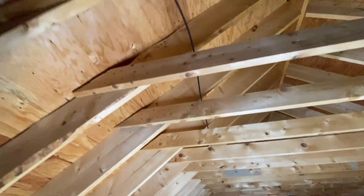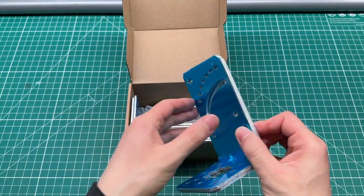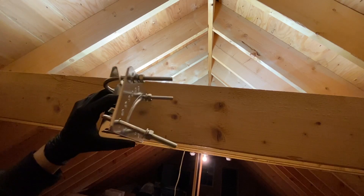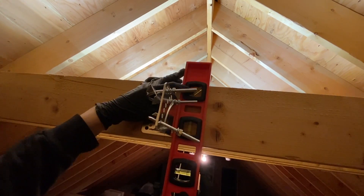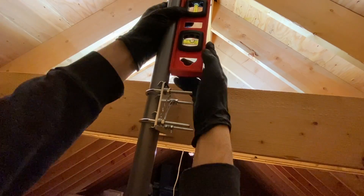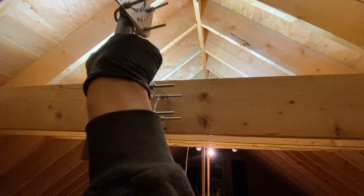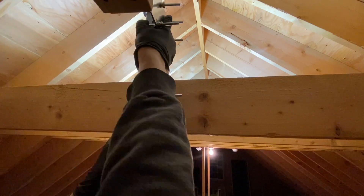I have my cable loosely laid out where I want it but not secured down yet. I bought a four-pack of light duty aluminum mounting brackets for an antenna mast. I want to mount the antenna before I start cutting and securing the coax. After some leveling I got the mount positioned pretty well. I didn't account for not having much vertical clearance, so mounting the antenna on the pole was a little tricky — a shorter length of pole would have worked better, but I managed. The aluminum mounts are pretty decent but definitely light duty; I wouldn't trust them with a heavier antenna or use them outside.